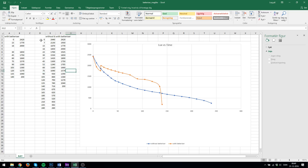I took the numbers from the flashlight tests and put them into a graph. The blue line shows the test without the Batterizer and the orange one with the Batterizer. We had this sudden jump — I think that's where the boost converter kicked in. Then a funny drop and it drops out after 140 minutes. It is significantly brighter, but it doesn't last as long. According to their claims, it should have been a straight line going all the way to the 140-minute mark and then drop straight down. But it is a linear decrease, so they do not maintain a constant output voltage of 1.5 volts as they claim.